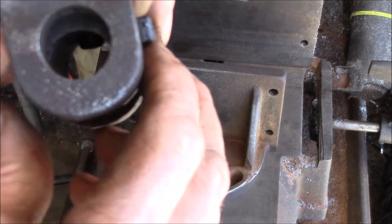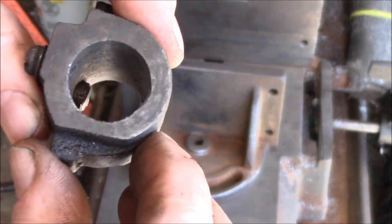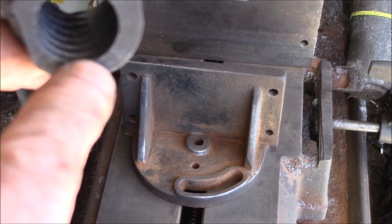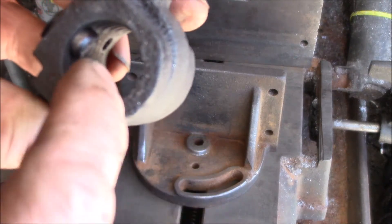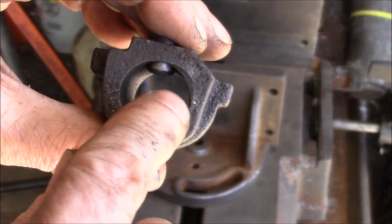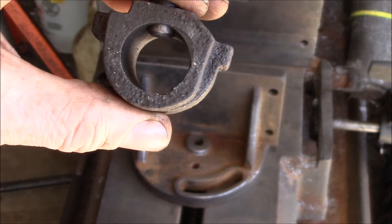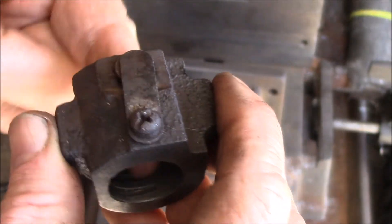You can see the acme thread screw goes through the middle. Inside here it's only partly threaded — you can see one side is smooth, but the other half is threaded. It's kind of angled — the threads are at the very bottom on one side and farther up on the other side. The inner diameter here is about 0.895 inches, almost nine-tenths of an inch, and the lead screw is about 0.833, so this opening is about a sixteenth of an inch — about one and a half millimeters — bigger than the lead screw, so it's loose on there.